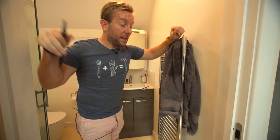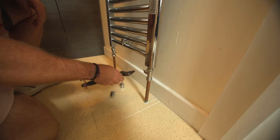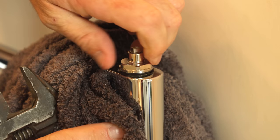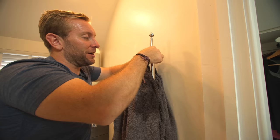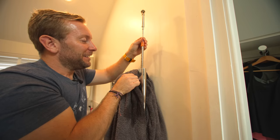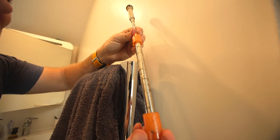Here's how you do it — guess what, the first thing we do is turn off the valve yet again. Any pressure in here we would bleed out. Then we'd use our adjustable spanner to undo it and carefully take it out, giving it a little wiggle as it goes. The good thing about this is that if you've got a tall radiator near a ceiling, you can take it out and collapse the telescope as it comes, which is kind of handy. Oh wow, look — it's actually got magnetite on it already!